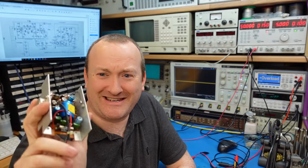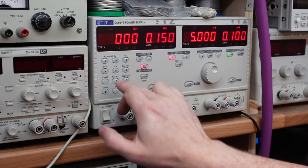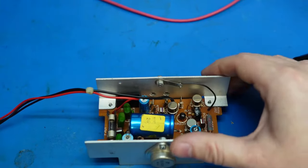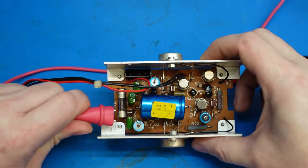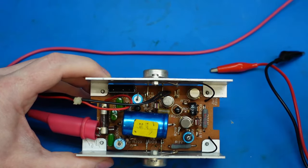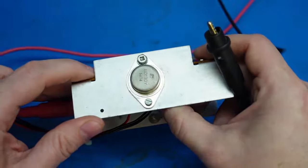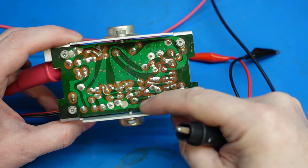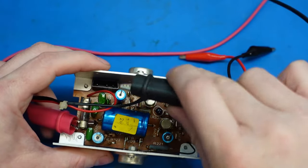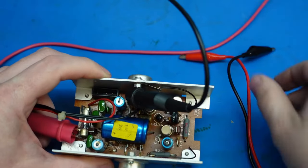And if it is a blown fuse, why is it? Let's see if it works. I'm going to make the connections onto this - start with the power. I've got 50 volts dialled into the power supply, which bypasses that fuse. We need to connect the ground to these black wires. It's easiest to connect actually onto the emitter of this transistor. We'll pop that in there.